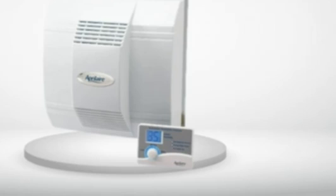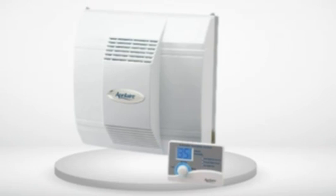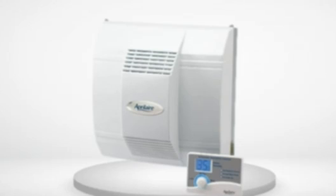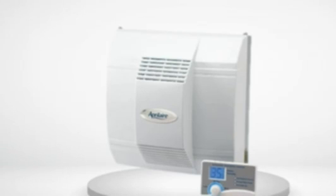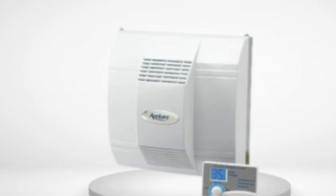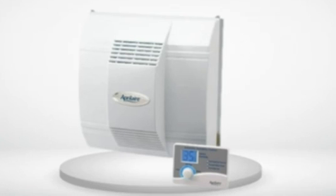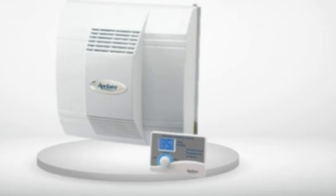Thanks, and I hope this helps. P.S. My humidifier continues to work with the original parts. The only part I need to change is the filter every year and do some cleaning at the end of the season. P.S. Point 2: My humidifier kicked in last night. The amount of water running into the drain is about 2 cups per minute — about 120 cups per hour of active operation, roughly 7.5 gallons. My humidifier works for a few minutes in each furnace cycle. I have a saddle valve so I cannot control the flow, but you could install a small quality valve to minimize water waste.